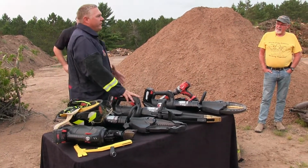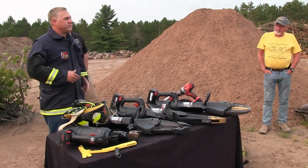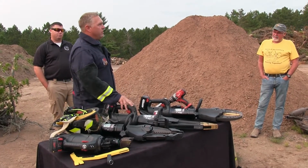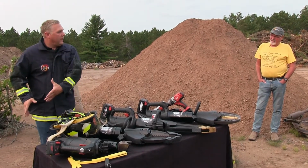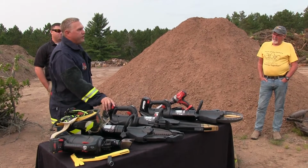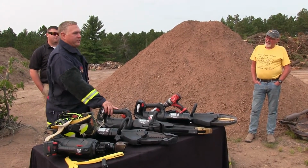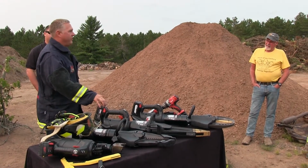Now, if you've ever been on a scene, you know what happens. We've got adrenaline, and we're trying to work fast, and it's confused. And so it's not uncommon that you would have this running, set it down, and leave it to go get a cutter, right? Well, if you're doing that, aren't you going to drain your battery? No, because this is going to shut off if it hasn't been run for 30 seconds. And this battery has a continuous run time of 30 minutes.